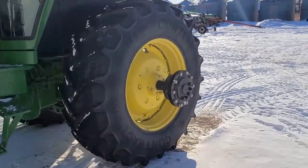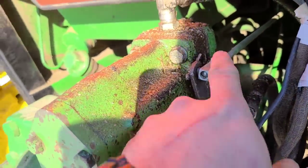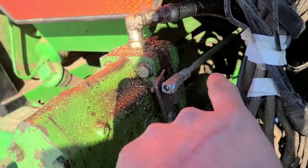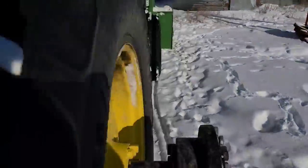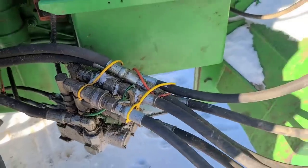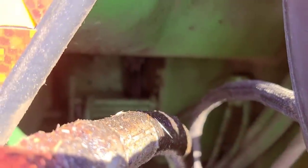Here's the 4640. So this is that power-beyond block — for the John Deere you need it, and International uses the same thing but theirs are down by the transmission. That's what provides flow to your valve and then you can still have your remote without losing anything. Right now I'm running the grapple fork off of it — because of that I need o-rings in that valve that's in the shop — but here's everything all together. Here's the cables, they run back and up into the bottom of the cab.